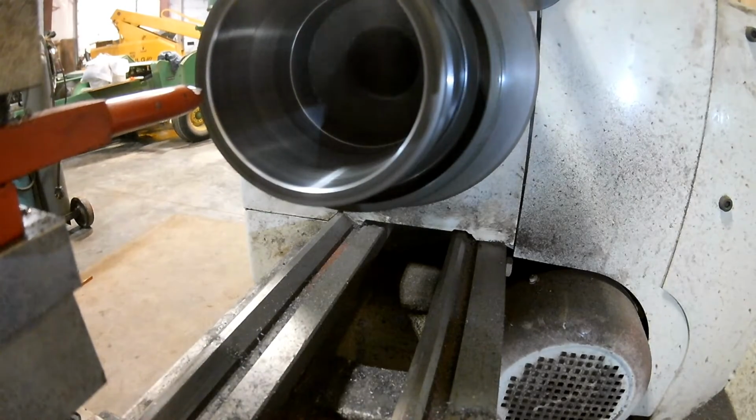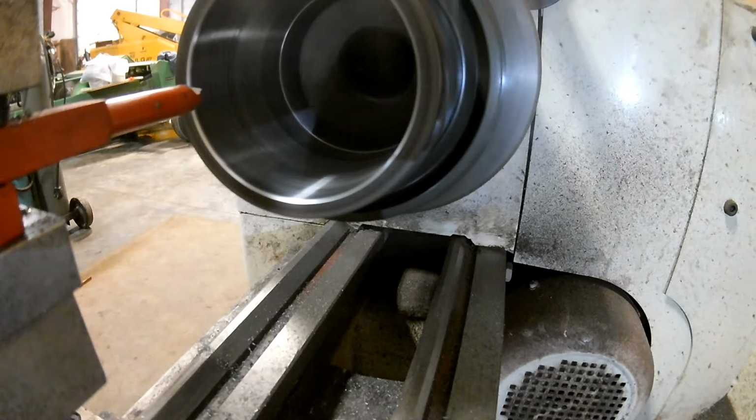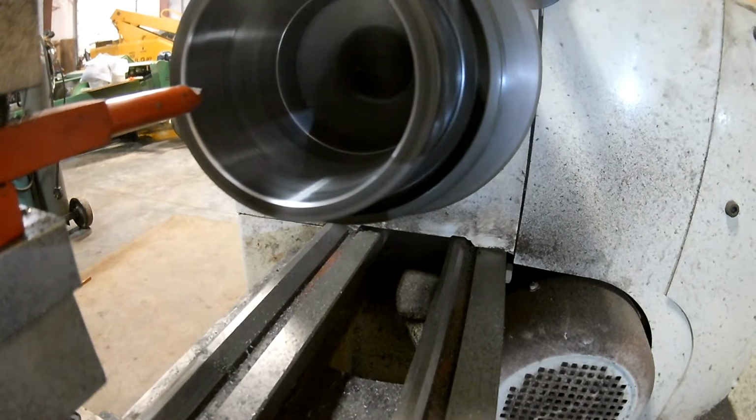Alright, only a bajillion passes later, we're finally about there. We're getting down there. You can see that center strip where the oil groove in the shaft was. Still a little bit high, but we're getting her leveled off. You'll hear it on entry here, and then you'll hear all of a sudden it gets quiet, and then when it gets the oil groove again, you'll hear it cutting again. Also, the downside of tool deflection of our turd of a Harbor Freight cutter, and we might have already chipped the carbide bit on it, so it ain't cutting its greatest either.